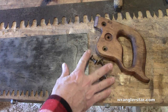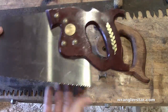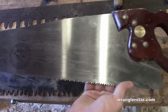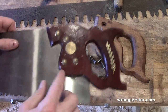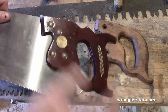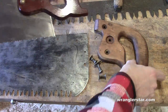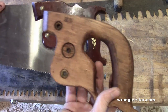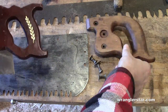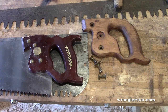I have three different types here and we'll see which will be the best fit for Henrietta. On a side note, my carpenter's hand saw here — the Golden Guinea, a fine saw from Sheffield, England — has a five-riveted handle. One, two, three, four, five. That is the sign of a quality saw. Five screws are going to hold better than three screws. Here we have a saw that's maybe two or three times the size being secured with only three screws, so that in itself is just destined to fail. So we're going to get rid of this and find a more suitable handle.